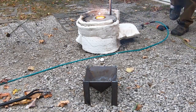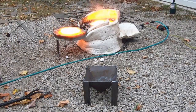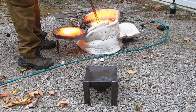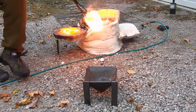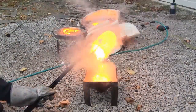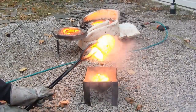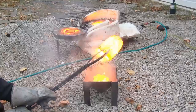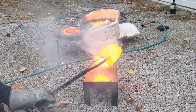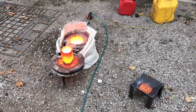We're shutting down. We're going to pull the crucible and get a look at this pour. I don't think I added enough flux. It does look nice and hot — we are good white hot here. So just from the color temp chart, we're definitely blazing. But that's terrible. It's just not liquid enough. We're probably still in the 2,400 degree area. I think we did hit 2,500 — it just took us forever. Actually, this was a 37-minute run that I had to cut short because of the rain.